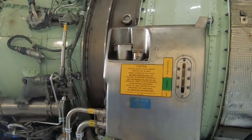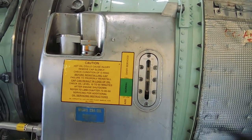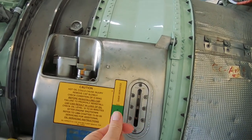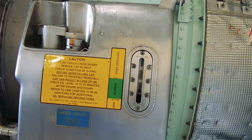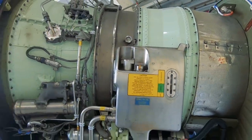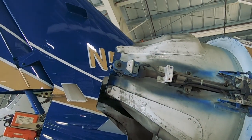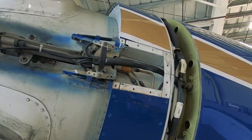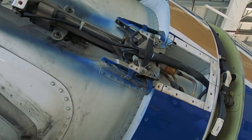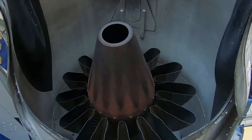All the same stuff over here. Here's our oil container — there's the oil level so we can read that. There's actually an access panel on the outside of the cowling and we can flip a little door in there and see that oil level. Looks a little low to me right now, not too bad — just a hair low. Moving back again, here's our hydraulic actuator on the back for the thrust reverser. Got some hydraulic lines up in there. These are the safety locks — that's what actually locks them in place so they don't accidentally come loose while we're flying, because that would be really, really bad.